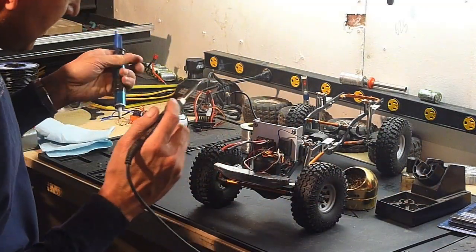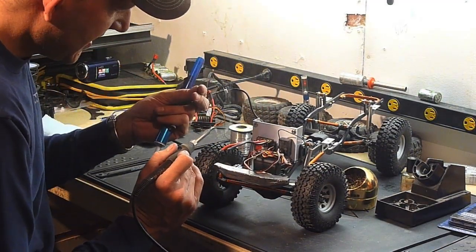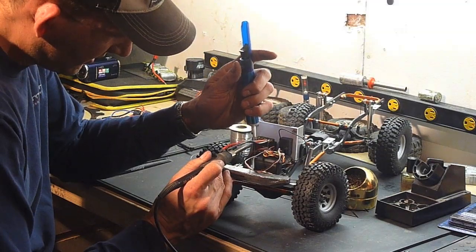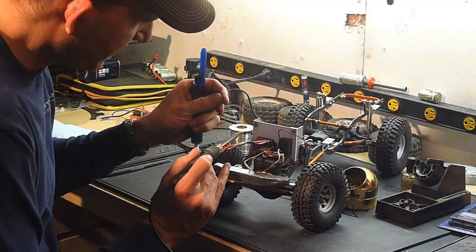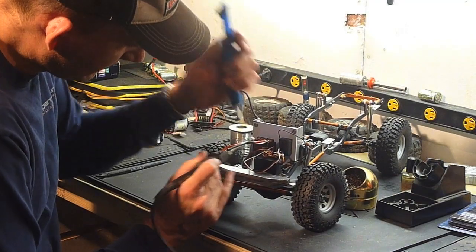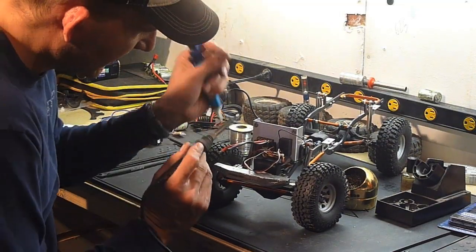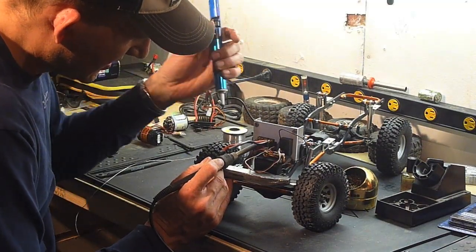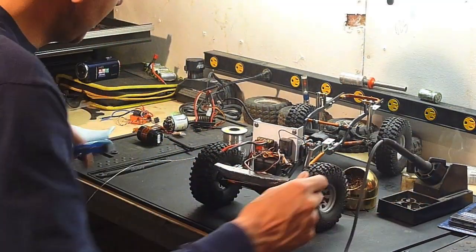But in any case, I'm just cleaning off the old solder, and then I use a solder sucker to suck all that old stuff out of there. Get a nice clean post to start from again. That'll be alright. Now you can see I'm actually adding solder in before I remove it, because it's actually the solder that helps with the heat transfer. So that's all pretty clean.